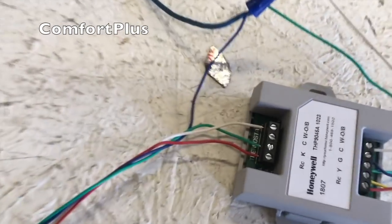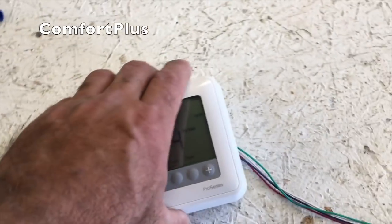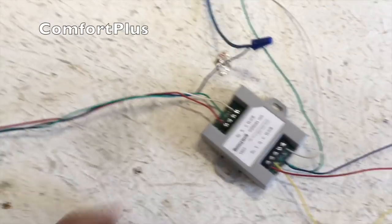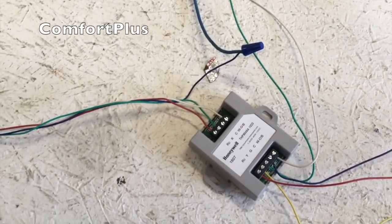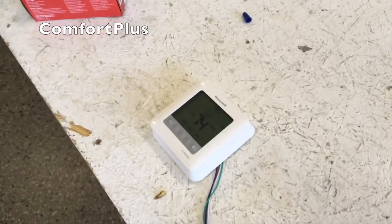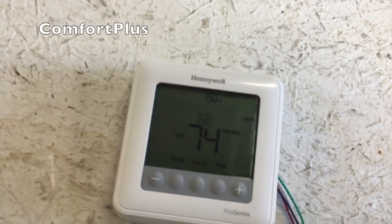So it looks like this is going to work fine without that common wire from the module to the thermostat. The only downside to this setup is they will have to use batteries in the thermostat, but AA batteries aren't that expensive and the thing will tell you when they get low. I'm actually really excited about this. These little modules, you're going to pay probably between 10 and 20 bucks for one depending on where you buy it, so they're definitely worthwhile. I have used one of these to add a common for one of Honeywell's new T6 WiFi thermostats and it worked for that, but what I wasn't sure about is could I use this module and that thermostat without connecting them with a common — and apparently the answer is yes. I looked and looked on the internet trying to find whether or not you could use it without a common wire but couldn't find it, so I just set up a simulation and tried it out. Thanks for watching.